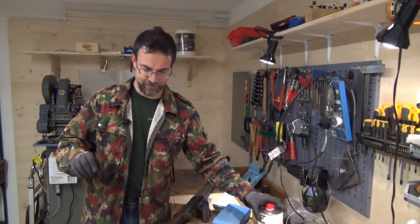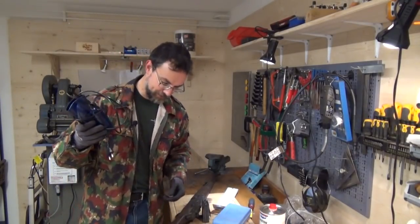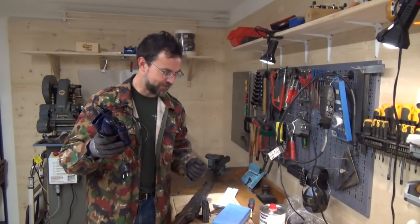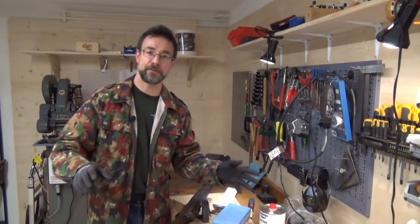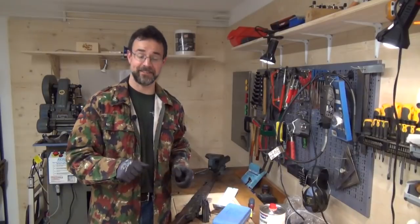Also, what was advised was to use a hairdryer just to melt a bit, to soften up the grease, especially in some of the things where it's become particularly crusty, just to lighten the load on the acetone so you don't attack it too hard. It shouldn't affect the wood. It might raise the grain a bit, but that's not a bad thing.